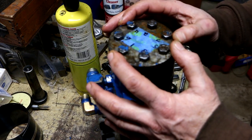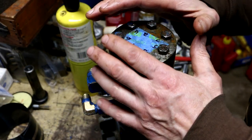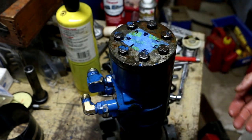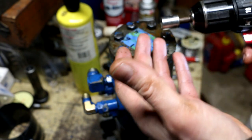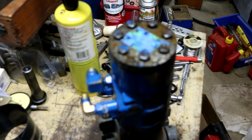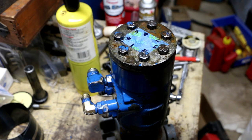So if you follow me, when we're done, we want these all to be torqued down to 15 to 19 pounds, but we don't want to go right to 15 pounds and torque this down because it'll be uneven. It'll be uneven pressure put on that seal and it'll damage it. So what you do is you start off by finger tight, and then I'm using my drill with the clutch at the weakest setting, and I start with that. Once I do that a couple of times, now I'll move to my inch pound driver.